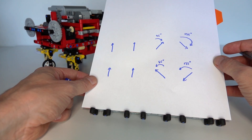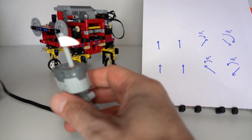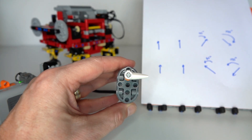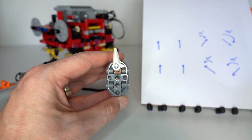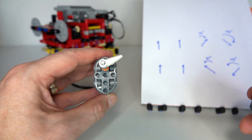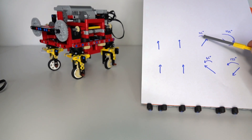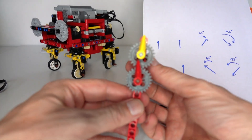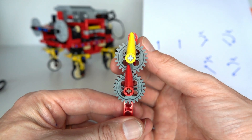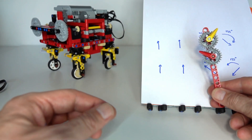I needed to create a 45-degree angle, and the first thing I thought of was the LEGO Technic servo motor, which generates exact 90-degree angles. With a 2-to-1 gearing ratio I can convert that 90 degrees down to 45. To rotate one wheel 45 degrees clockwise and the other anticlockwise, the obvious approach is two meshing gears - meshing naturally creates opposite rotation directions. By rotating the top gear clockwise, I effectively get the configuration needed for the left side of the vehicle.